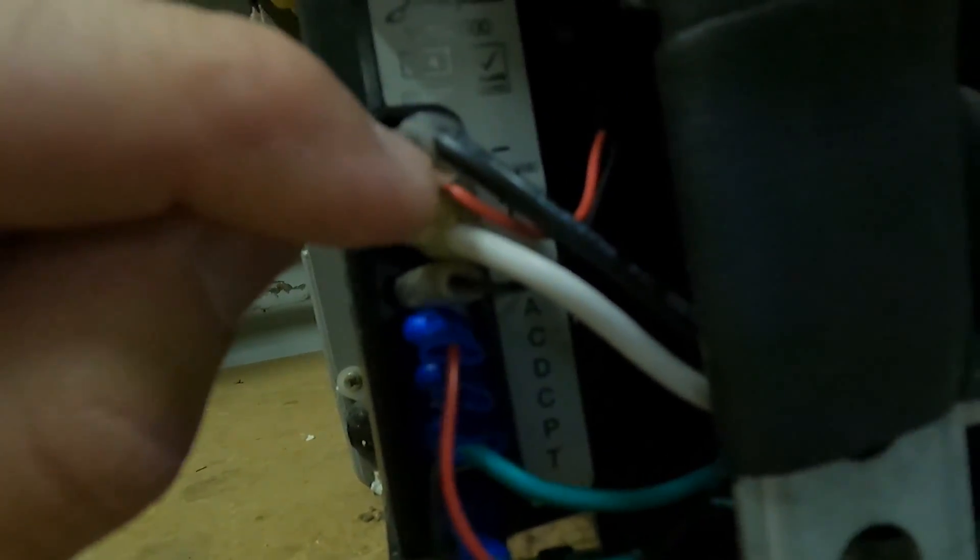Off the positive, this is one of those piggyback terminals. The red wire here is the original and it goes to the fan, and the negative for the fan is this black one here, which goes into the F for fan terminal. The two below it are the A and the C, and that's for your light inside your fridge — I didn't really want to lose that. Those wires are the originals; they followed down with the other wires from the controller and went into the motherboard on the back of the power-in. I've just cut those wires and put terminals on them: positive goes to A, negative goes to C, and the light's working nicely in the fridge.